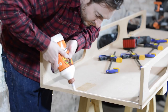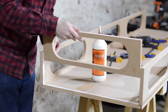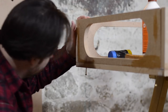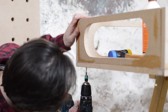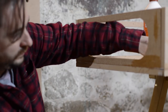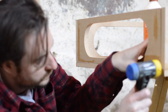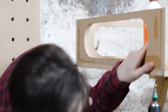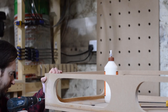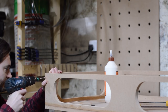The ends go in exactly the same way — just a bead of glue going all the way around, and then they slide into place and they're a nice snug fit. I didn't worry about clamping the ends; I just screwed them in place, and if there's any fine adjustments that need making I just use the mallet to knock them around. When the ends have been screwed in from below they also need tying into the sides, so I drilled and countersunk a couple more holes and then put some screws in.